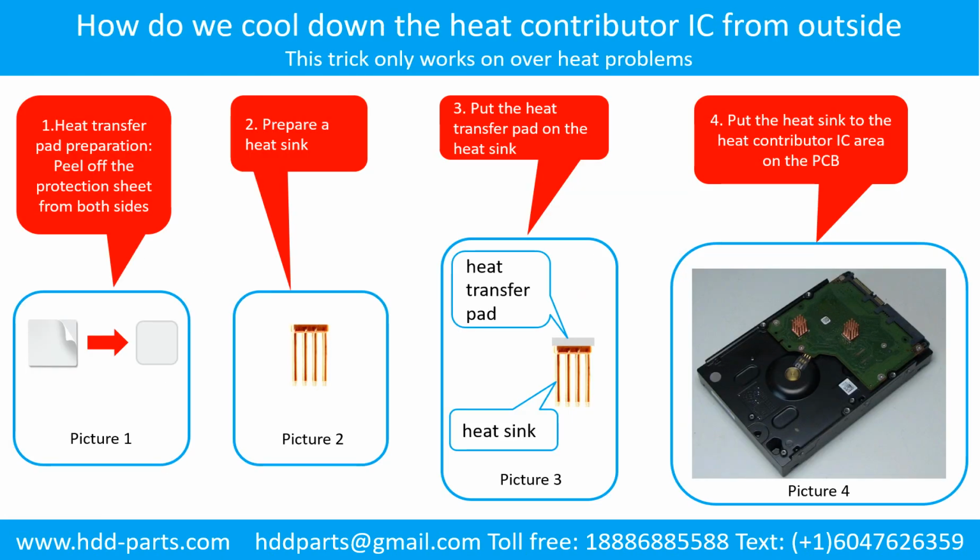How do we cool down the heat contributor IC from the outside? Step 1. Heat transfer pad preparation. Peel off the protection sheet from both sides of the heat transfer pad, as picture 1 shows. Step 2. Prepare a heat sink, as picture 2 shows. Step 3. Put the heat transfer pad onto the heat sink, as picture 3 shows. Step 4. Put the heat sink onto the heat contributor IC area on the PCB, as picture 4 shows.